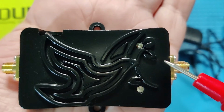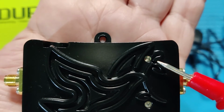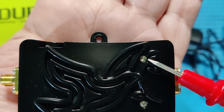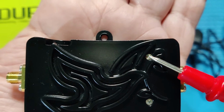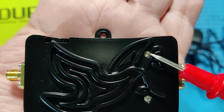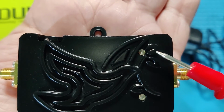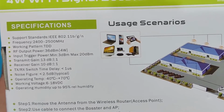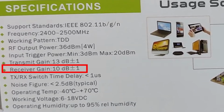A bidirectional amplifier works on both sides, that is on the transmit side as well as on the receive side. So it has two types of amplifier within it. One is the power amplifier for the TX and other is an LNA for the RX. So red light shows the activity of RX. Its RX gain is between 9 and 11 dB.